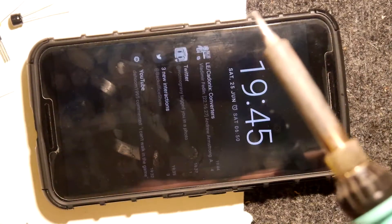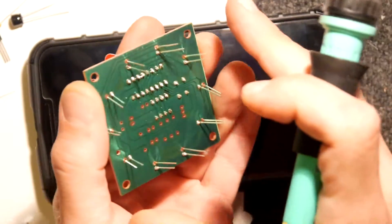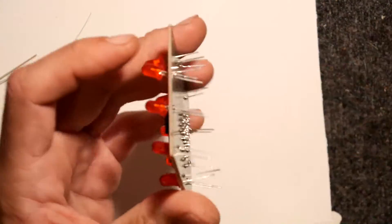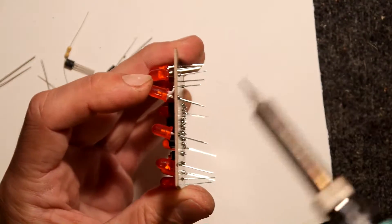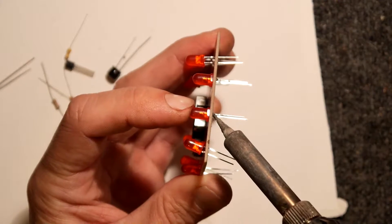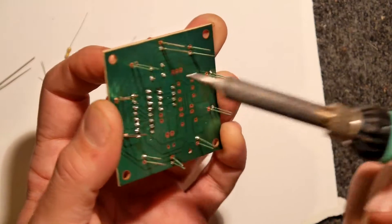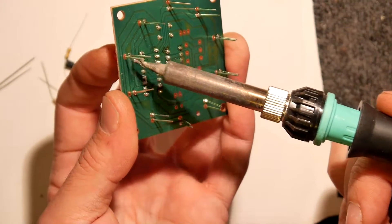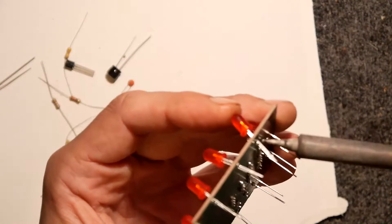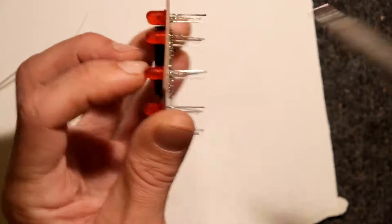All of them apart from one I didn't do properly - I'll just push that through and touch it up. They're all captive now but they're all a bit on the wonk. So what I do: get your finger on the end of the LED and then just touch that tack blob of solder on the shaft - you see how the LED just sits down? Go around really quickly doing that. I'm going around touching each LED's tack blob and it doesn't take any time at all. Once they're all sitting firm and flat, we go to the next stage.